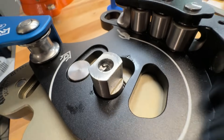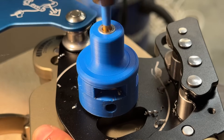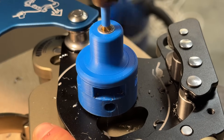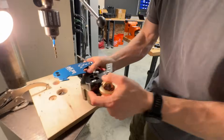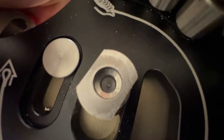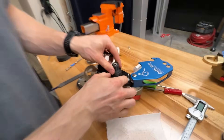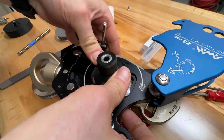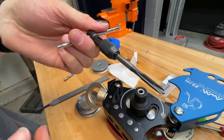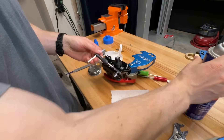After drilling out the rivet we need to tap the shaft, first starting with a 5 millimeter tap drill because we are using an M6 bolt — it fits nicely with the 8 millimeter hole that the rivet leaves behind. Now we have the pilot hole for our M6 tap. There's a 6.1 millimeter bushing in this jig, so I'll place that on and use a tapered tap. I'll give it a little bit of WD-40 just so it cuts nice.